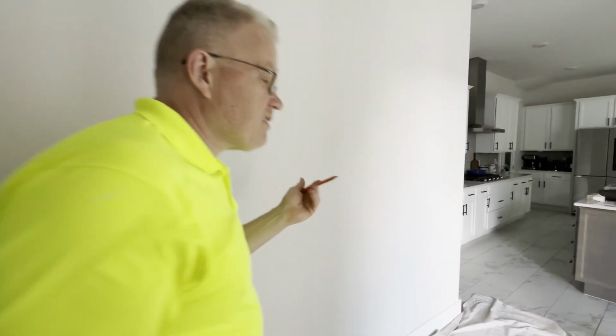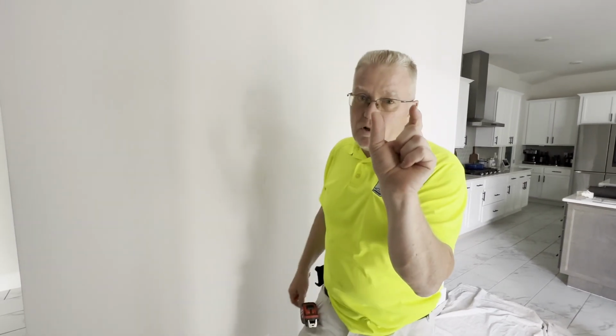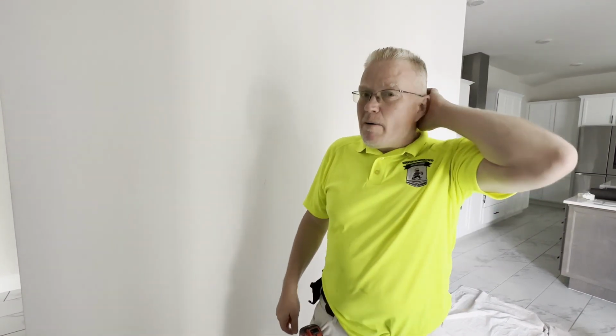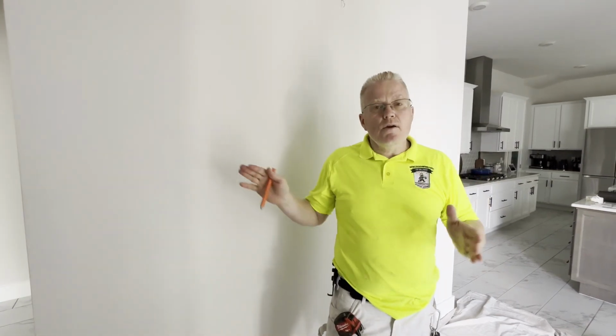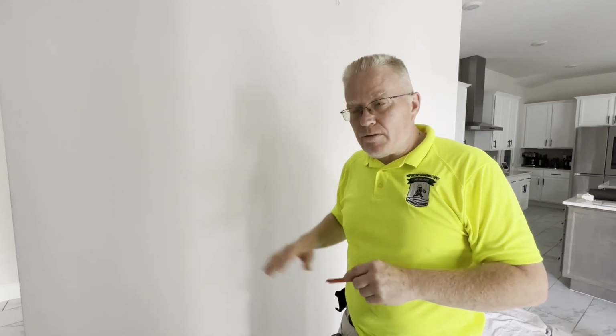Let me explain. Okay, so how do we measure for grasscloth? Real quick, if you're doing an accent wall, what I'm about to show you is extremely important to follow. But if you're doing a whole room, your seams are going to fall where they fall, despite your best efforts to put them in the place most strategically advantageous to yourself. You never want to strip a wall covering this far away from a corner, but it may happen when all other things are considered. So there are some general rules to follow when you're doing your layout, or what's called engineering the room. It's very simple.